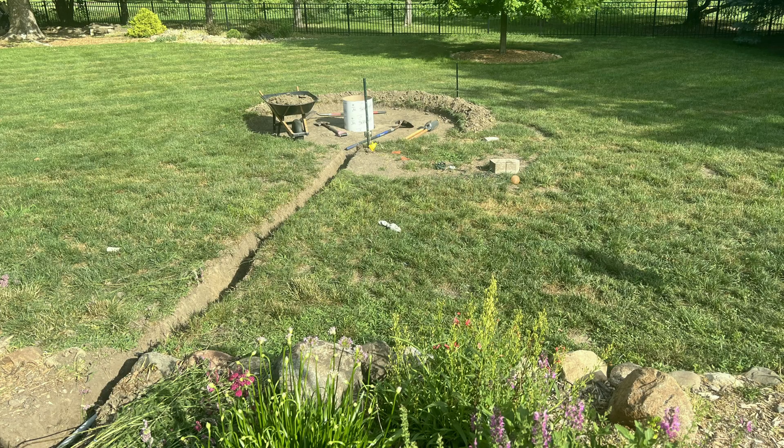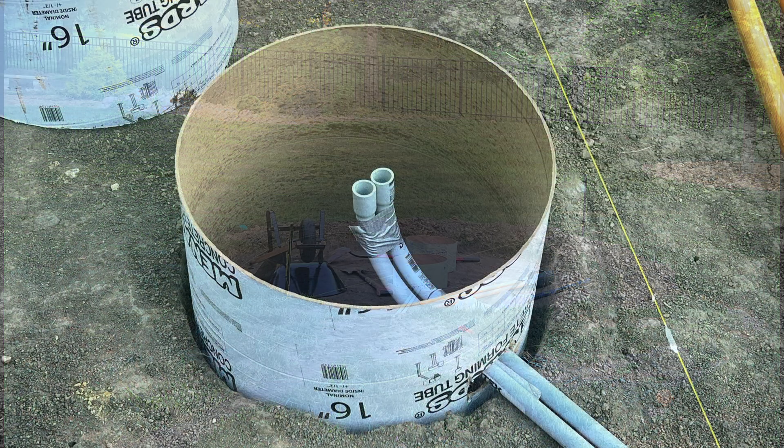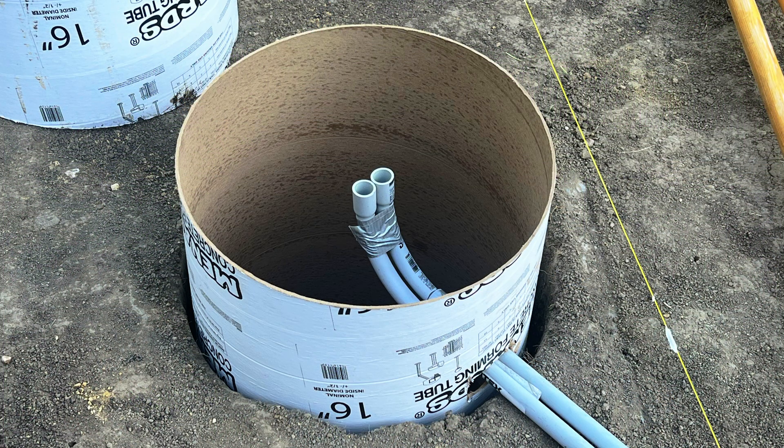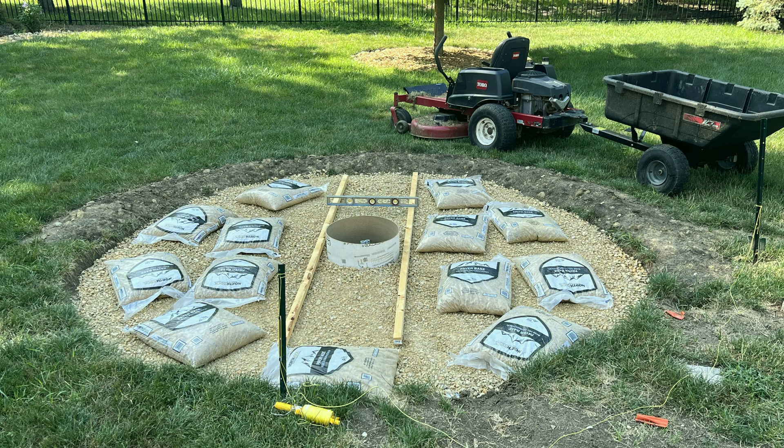That hole is 16 inches wide by 40 inches deep. Our frost line's about 36 inches here, so for code we've got to be below that. I did a test fit on the pier, as you can see. And then I also dug a trench over to that to allow for the electrical and the conduit to go in, getting the height set on the top of the pier and the conduit run through it.